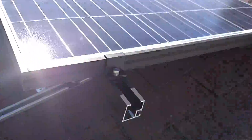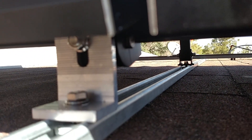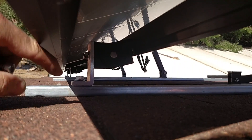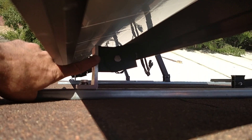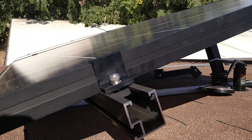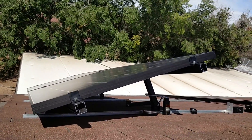There are some more end clamps. Going around to the front of the system — I've got my L-feet going straight to the unistrut, which is this piece here — this is galvanized unistrut. You can see the L-foot tied into the unistrut, then I've got my angle brackets which are the pivots, and that allows my rack to angle back and forth just like this. That's what you need in order to be able to get the 18-degree tilt, 17 and a half — whatever you want to call it.